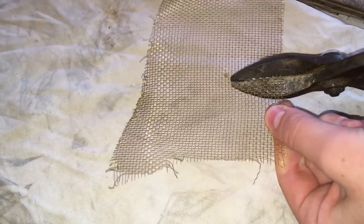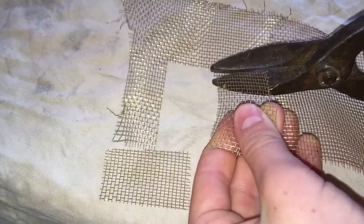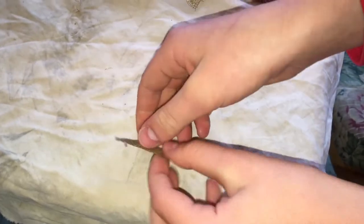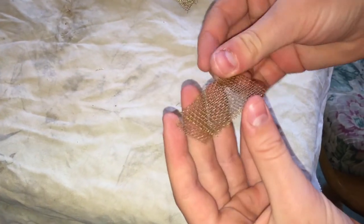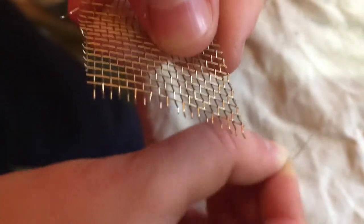The charge pickup brushes are made from this brass mesh material. I cut 2 small pieces out of this brass mesh, and then removed a few of the crossbar wires to create a fine line of points.